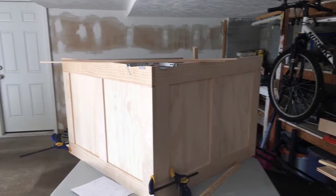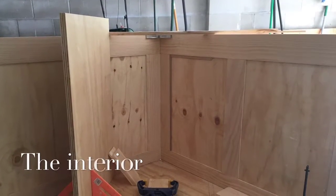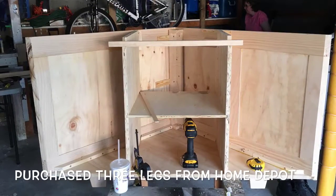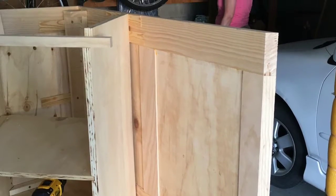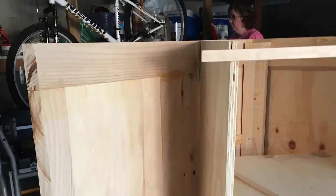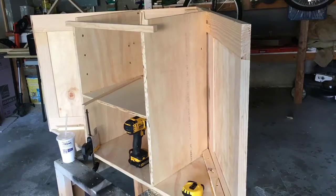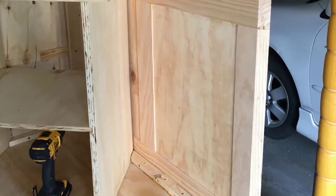I used shaker style for the exterior walls just to give it character. I used ¾ inch plywood for the base on the bottom and then used ¾ inch 1x4s from Home Depot for the top. I dadoed a ¾ inch slot so it would be easier for them to connect to the bottom plate. Then I used a center cove to carry both the stereo equipment and other things such as storage, connecting them to the exterior wall to give more strength.